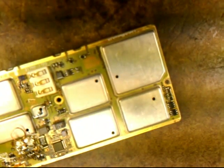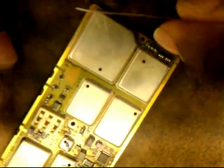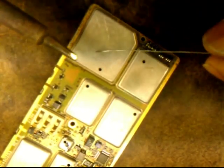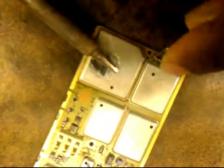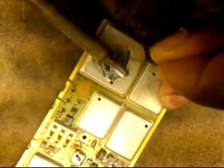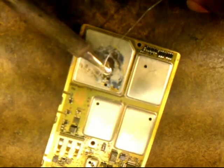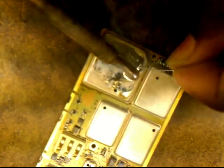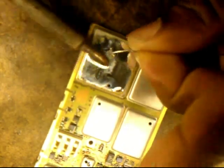I've been removing this so many times that I don't even think about it, but for other people it's not easy. I'm trying to show it from the beginning. I apply a lot of solder, I heat the plate up, and I use a ton of solder — I dump solder into it. The purpose of doing that is making the whole thing really hot.